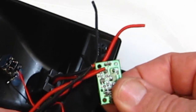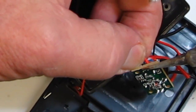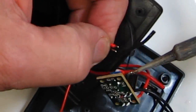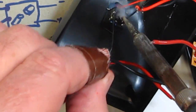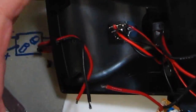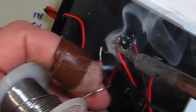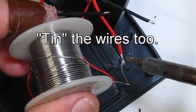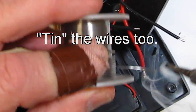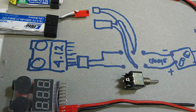It's pretty easy to actually remove these wires. All we have to do is grab these two wires on this side — remember the plus is over here at the top — and heat these two up at the same time. They'll pull right out. I'm going to tin the terminals to make this easier to solder, first of all. Since the red wire on the diode is on the top, I'm going to put all the wires red on the top. You want to tin the wires too. Tinning means to melt some solder on the wires or the connectors first, and that makes it a whole lot easier to solder when it comes time. If you can't see what I'm doing right here, just refer to this simple schematic and I'm sure you'll be able to easily figure it out.